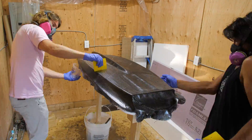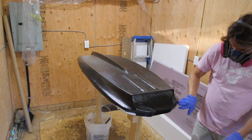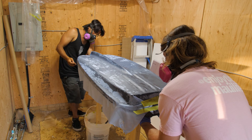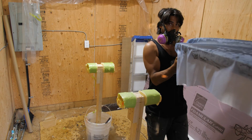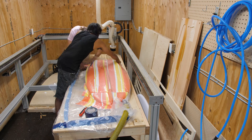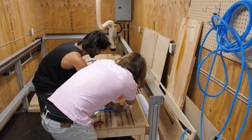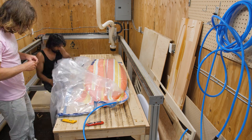Riley helped me out with the lamination, and this is actually my first attempt at vacuum bagging a board. We dropped the peel ply on top so that the breather cloth doesn't get stuck to the carbon fiber while the epoxy is curing, and then took it over to my machine side and threw it in my vacuum bag. I did a horrible job sealing all the holes, so Riley and I spent about an hour listening for little leaks and sealing them up before leaving the board overnight.